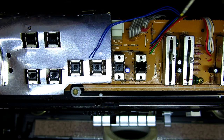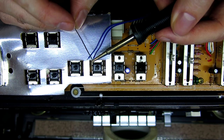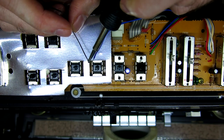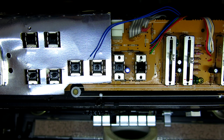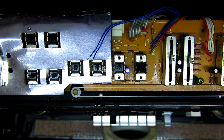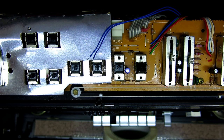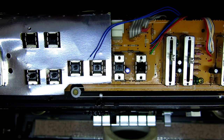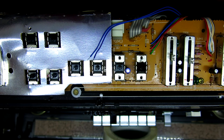I've just cut one of the blown bulbs off and measured it on my calipers — it's a 4.2mm bulb, most likely a 12V bulb. I'm going to tin the ends of these wires, find which one is ground by measuring continuity, and then power this up to double check that voltage. 12V bulbs in 4.2mm — wire-ended bulbs that you solder are still available. So if we solder and heat-shrink them, we'd end up with exactly what we started with.